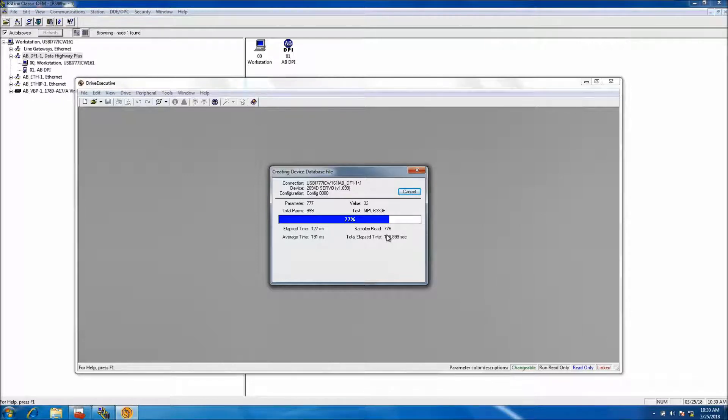You can see the firmware version of the 1203 USB I'm using. You can actually update the firmware of the 1203 USB — there's a misconception that it's just a fixed converter. It's a Rockwell converter, and like anything else they increase the drivers or provide a different driver when they find a feature to improve, which they have. If you see a tech note saying you need a specific firmware version, that's rare but it does happen.